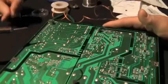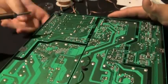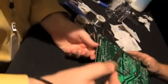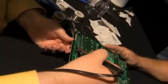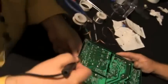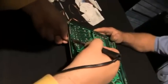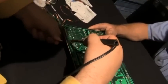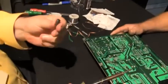One thing I often do is come underneath and pry on it, pulling to one side, see? And then I'm loosening it by doing that. And then here, I'm loosening this one, without pulling so hard I'd break the capacitor. I pulled that out, see? It popped out from the bottom.